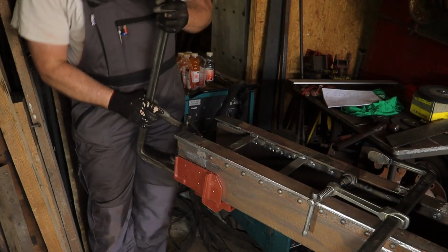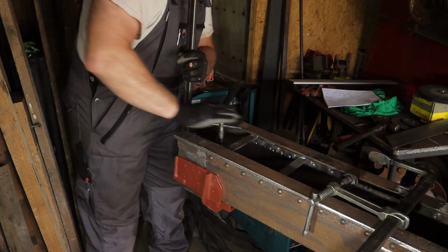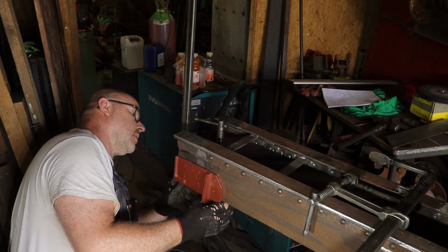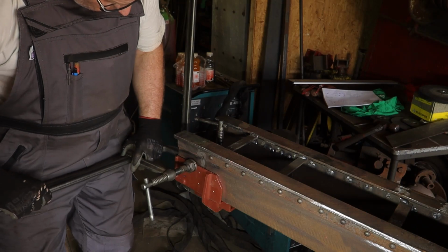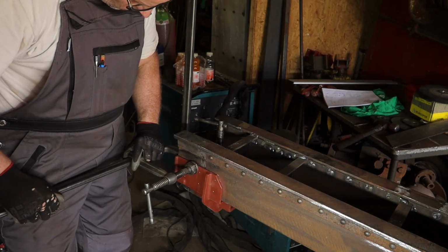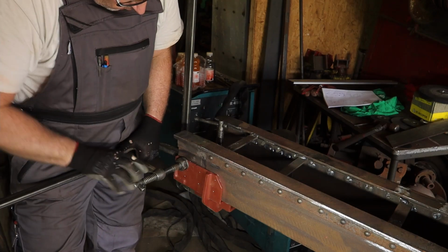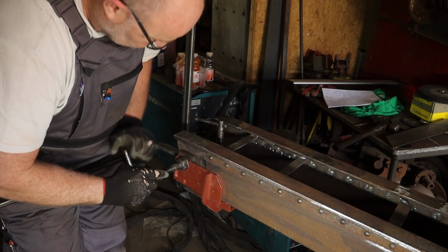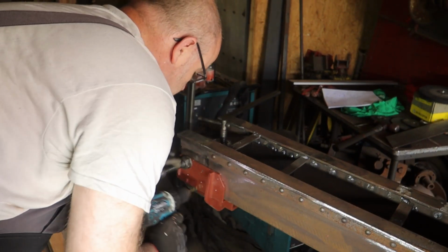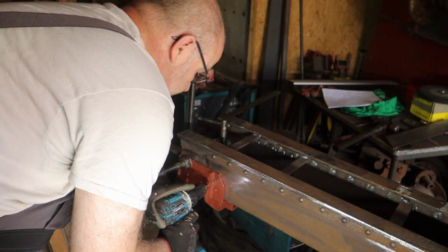So first a few clamps on it to make sure everything is tight. So the bottom is okay. Now the sides. Of course, leave some room for drilling. So here's the biggest opening. We'll clamp that first on the place where I need to drill the hole, but then I can put the bolt in here when I've drilled it, and then move the clamp over. We'll put 2 in first, bolt it down, and then we remove the clamp and then the rest.